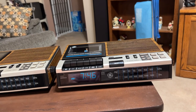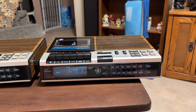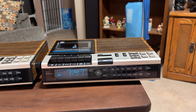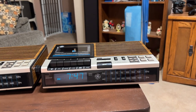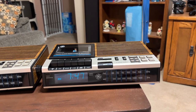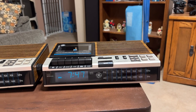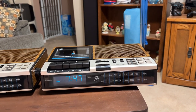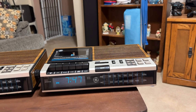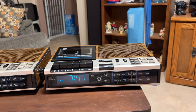Fast forward to 2023. The issue is the last time I went to use the tape deck, it did not turn anymore. I never did change the belts in it. Last time I had it apart was in 2007, and I merely cleaned the belts. So it was finally time to replace the belts in it, needless to say. And that fixed it. But while I had it apart, I cleaned it up and cleaned the controls, and by chance, picking up the A version.